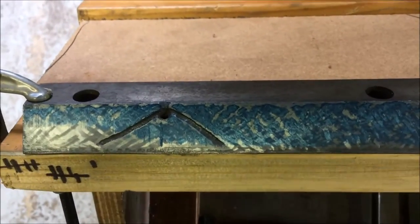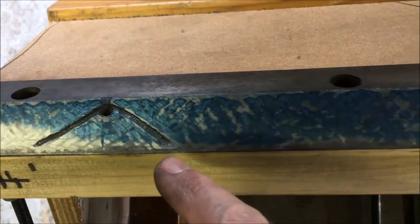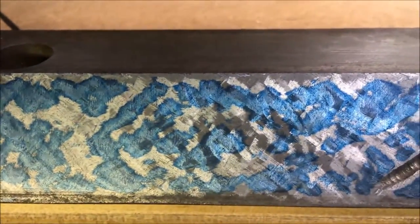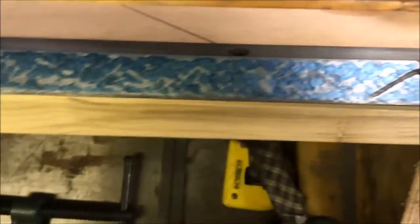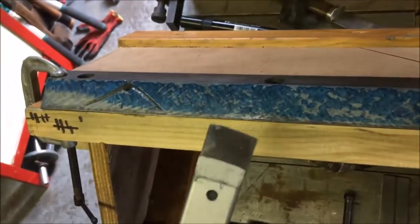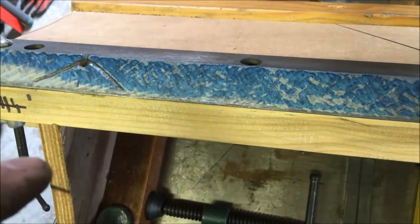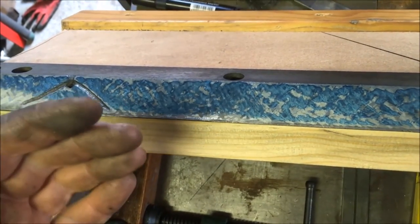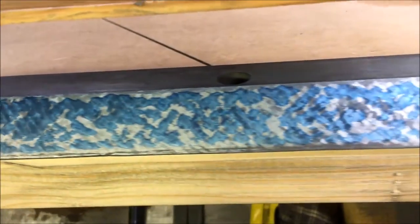We clean the ink off the part, spread the ink on the plate thinner - a little bit easier to read like that. One of the guys on the Practical Machinist forum has suggested that I reduce the radius on the end of my scraper - reduce it so it makes a narrower scrape but deeper, which in theory would give me bigger, deeper oil pockets and a more defined contact point. Next time I do a bit of grinding I shall be doing that.